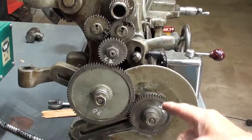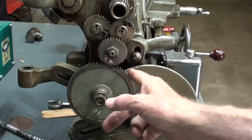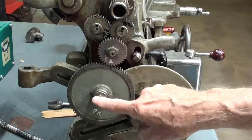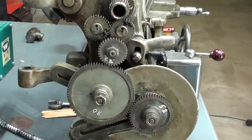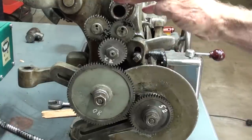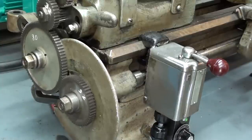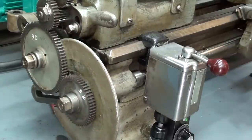What is the purpose of all these gears? It is to transmit power from the main shaft — from this gear here on the spindle — down through the gears, and then this is called the screw gear; it's on the end of the lead screw. We can get a ratio through these gears that will turn the lead screw and thus move the carriage at a certain rate in relationship to each revolution of the workpiece or the chuck. As I turn the chuck with my hand, you can see the gears are turning and the lead screw turning.